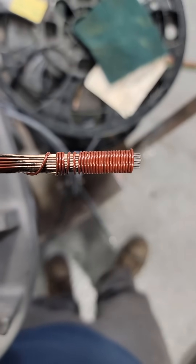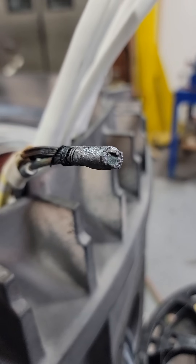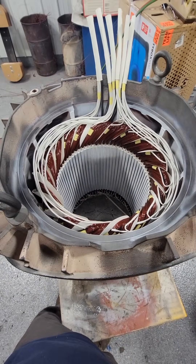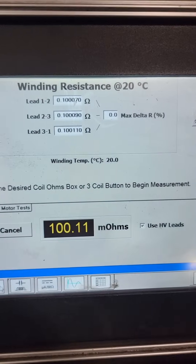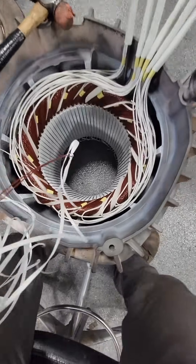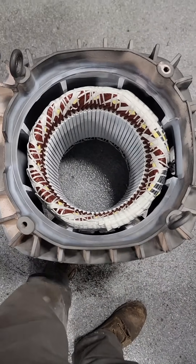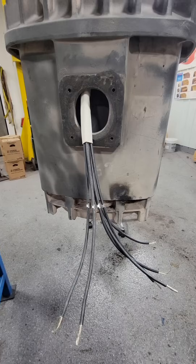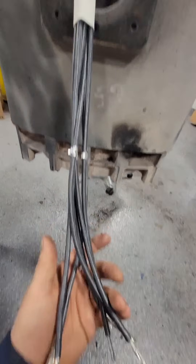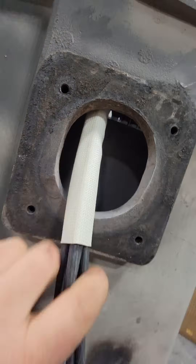To attach all of these leads we're going to burn that enamel coating off of those magnet wires, put our lead in there, and then use a brazing material to braze all these leads together. We'll tape everything and try to keep it as organized as we can. Before we tie this down we're going to stick it on a winding analyzer so we can see our resistance between all of our leads. Then the last step before we put this through the VPI process is to tie everything down or lace and brace it, make sure everything's clear and that our rotor is still going to fit through here, and that we didn't make our winding too long. My last step is to make sure all these leads are even with all our numbers on the same line, then sleeve everything up through that stator so nobody pulling on those wires is going to cut them and cause a grounding issue.